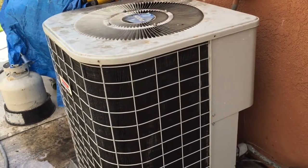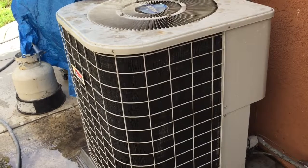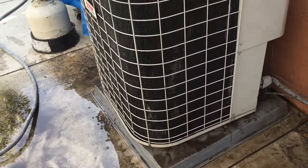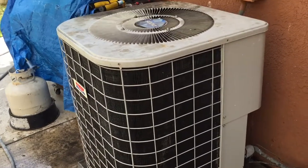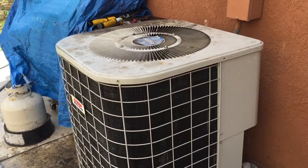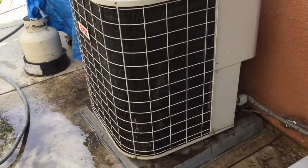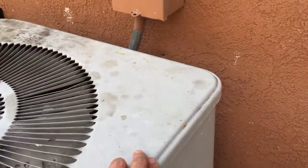Underneath in the bottom there's a lot of leaves, so I have removed some of them. I think the best way, maybe before you wash it, if you have leaves or something in the bottom of the unit, maybe use a garage or shop vacuum to get all of the leaves out. What I had is wet leaves in there, so they're going to get dry. So I'm not going to use my AC today. And then put the screws back and then put the fuse back later.